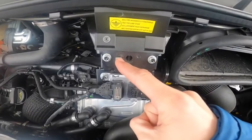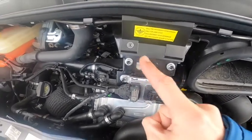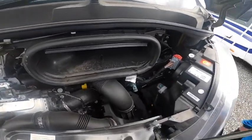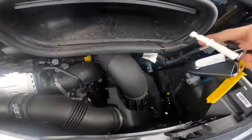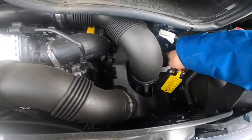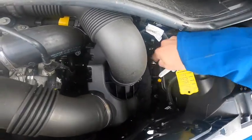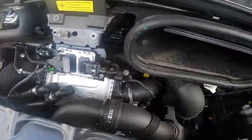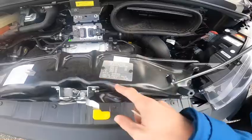This is where you'd earth if giving or receiving a jump start, as the engine battery is underneath the cab floor. For the positive connection, it's between the air filter and the back of the headlight. Lift this cover — red goes on there, black on there for giving or receiving a jump start. Then you've got your weight plate here.